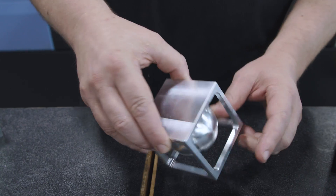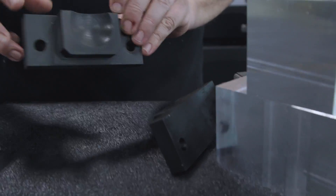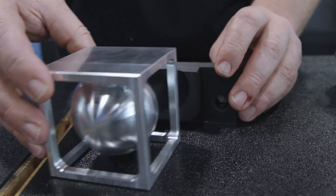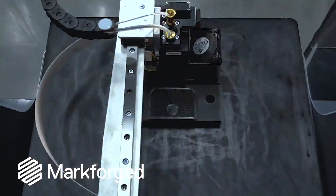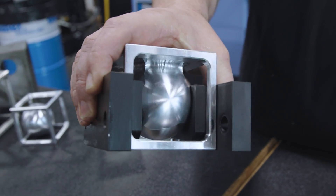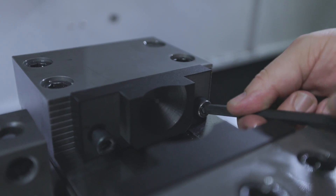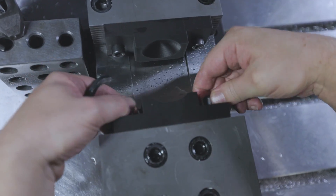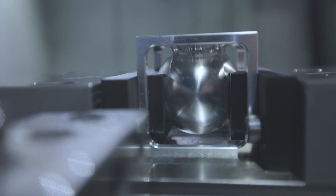Here is the secret to what makes today's project possible. Now that we've cut five sides of the part, if we go in to cut the sixth side, that ball is going to be free-floating at some point and just fall away from our cutting tool. So we had Trevor 3D print us some special jaws that are going to suspend this sphere in mid-air and hold the cage at the same time. These jaws could also be machined out of aluminum, but for the sake of simplicity, we decided to 3D print ours. We're getting ready to do our final operation. We use a different program for this last op — we cut our step-over in half while running the same feeds and speeds. With these plastic jaws, we want to be careful not to over-torque our vise, just get it snug enough that the ball isn't going to move once it breaks free.